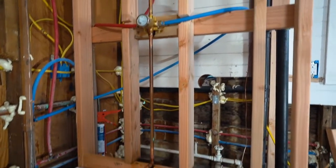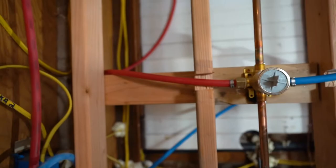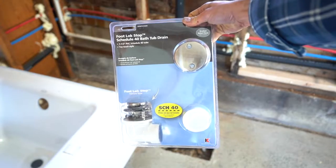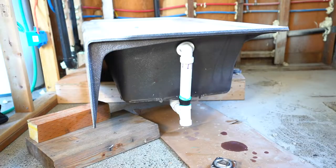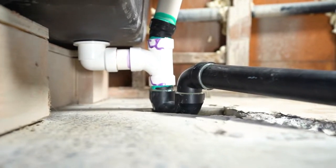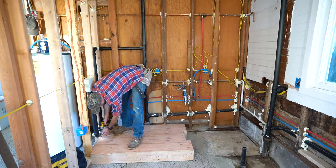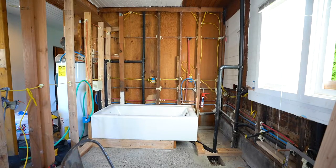Plumbing for the tub is pretty simple — I've included some shots of that so you can see how those tub assemblies go together. The p-trap just lives right under the tub. In this case, because there's a concrete slab, we decided to elevate it on a platform, and that allowed us to get our p-trap under there and get the plumbing to where it needed to be.